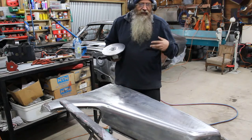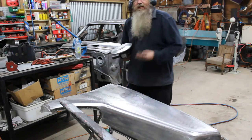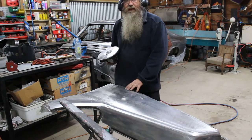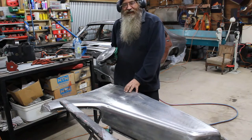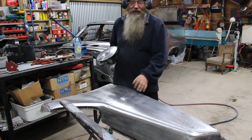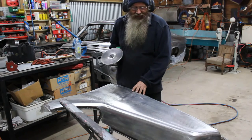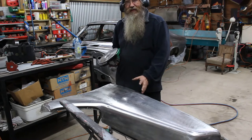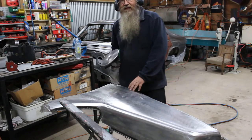It's going to be quite a bit of a job to get it up to how the factory made it. As you can imagine, every time you weld, you create a pitch and keep those distortions. Now, metal does three things: it stretches, which is how the panel was made in the first place — the same for this panel steel. It shrinks, but it doesn't do that so easily. And the third thing metal does is it does nothing at all, which is super bloody frustrating, because it just leads to two things: stretching and shrinking. Stretching is done very easily, and shrinking is not so easy.